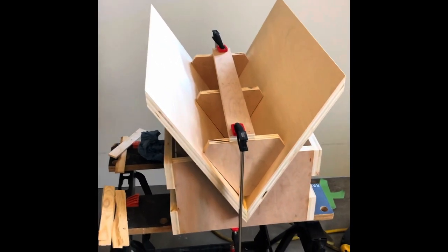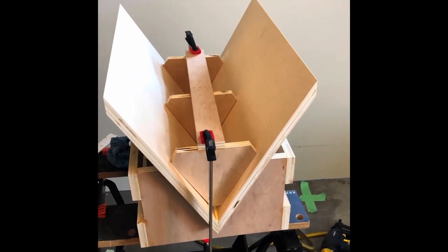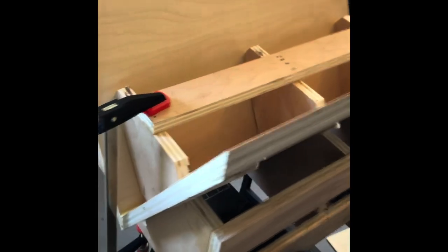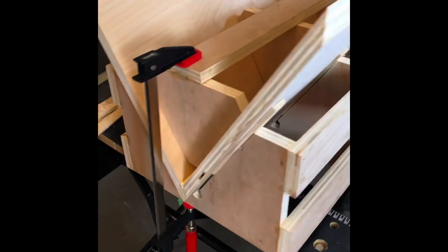Okay, so you can see here what I've done. I've got the pieces in there. I flipped and glued them and folded them into the jig, and aligned them as best I could using shims here on the side, just to get the angle as close to perfect as I could. I know it isn't perfect, but it should be sufficient. And you can see again on this side, I've had to shim it up to get the appropriate angle and so forth. Then I've got my clamp in here, clamping them on the ends. I don't know how well you'll be able to see any of this, but